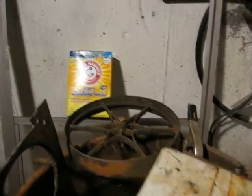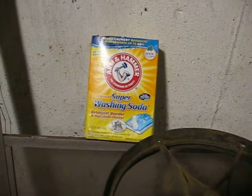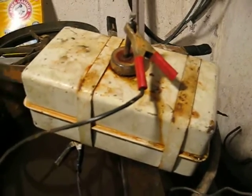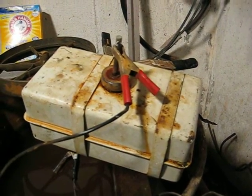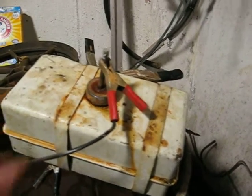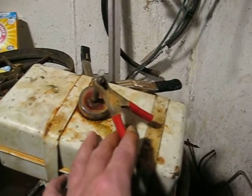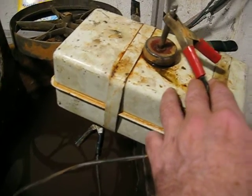And then, as you've seen before, I used my electrolysis tank with the washing soda, which is sodium carbonate. I just took some water out of the tank and filled it up. What I do is I put the positive, which is the anode, on a bolt — actually it's a connecting rod kind of thing — and this is a plastic cap here off of an Arizona iced tea bottle. Then I have the negative hooked up to the spigot on the bottom of the tank to clean out the inside.